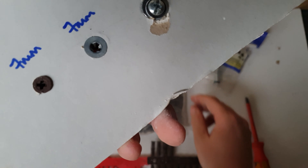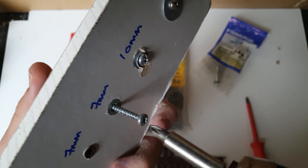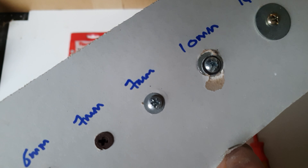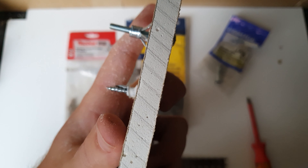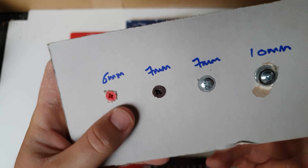To use these worms, they come with a pre-sized screw — you just put them in. If you use the wrong screw they can lock up inside and spin the fixing out. They just go through and then lock up. If you had a fixing or bracket, that's just how they work — gives you a thread in the wall basically for the screw to go into.